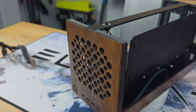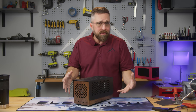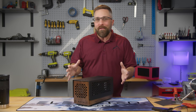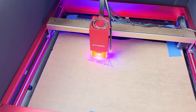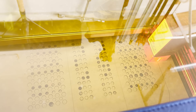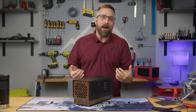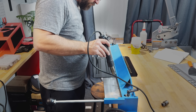With the case all wrapped up, the only thing left was the top cover — so I double-checked the measurements, made any necessary adjustments to the plans, and then proceeded to cut the panel, right? Well, of course not. As soon as I finished cutting the wood I couldn't resist the temptation to slide that big sheet of 3mm acrylic into the laser cutter and see how it worked. The D1 Pro made light work of cutting all of these 3mm and 5mm hex holes cleanly and effortlessly. It scored the bend locations and cut out the final shape like the pro it is — and then of course I managed to mess up the bend like the amateur I am.